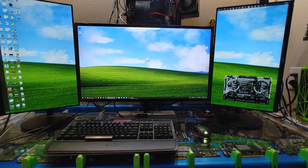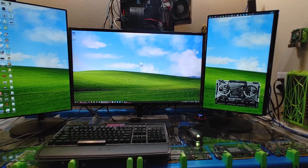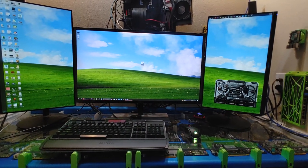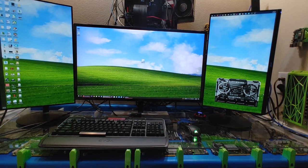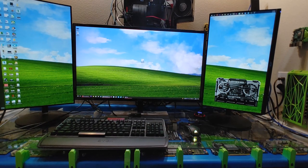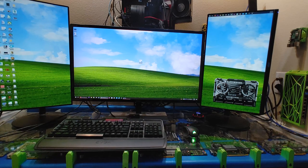The middle of this desk is supported with some PETG towers to take the brunt of the weight, while the front edge has these green supports made from RepRapper's silk green PLA. I've printed on glass to give the front edge a mirror finish. With normal PLA I typically wouldn't bother printing on glass since it takes longer to get that first layer down and preheat the printer, but with a good silk PLA like this one, the walls are shiny enough that having a glass bottom layer works well.